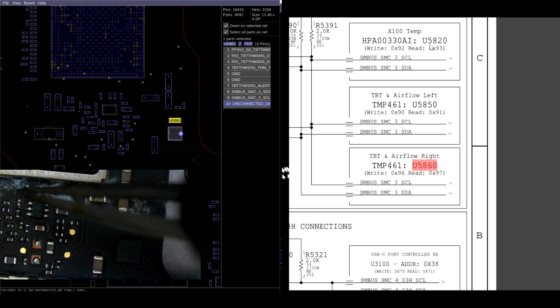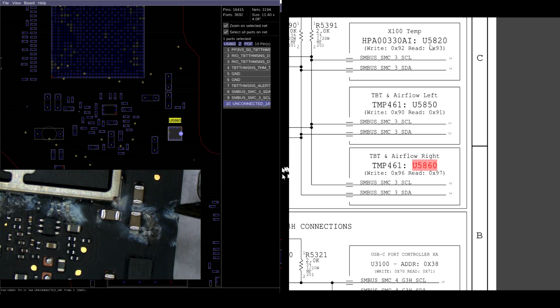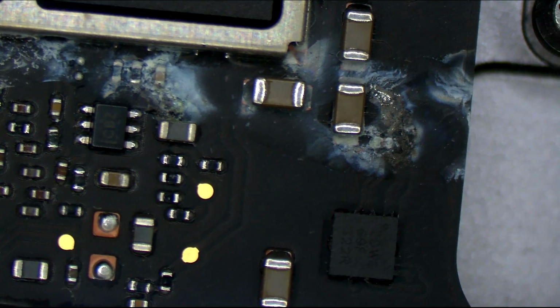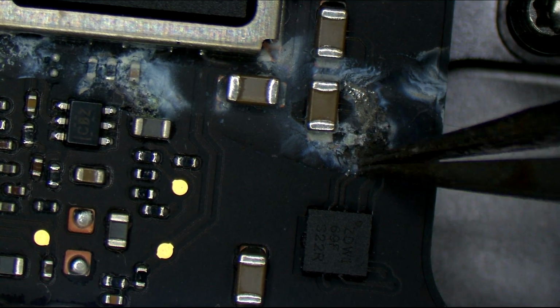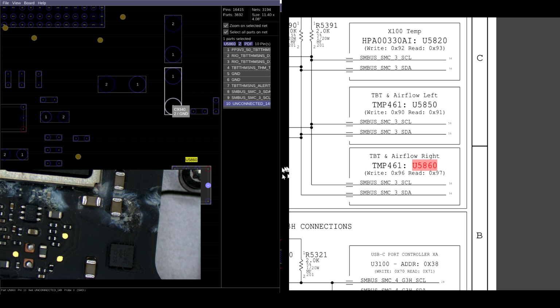Now, I'm going to guess that the stuff over here is not really that relevant, but that what's over here and closer to the chip that looks like it has lines going directly to the chip is relevant. So there's these capacitors, which I'm not really concerned about, but I am concerned about this resistor that's covered in soot, as well as that resistor that's also covered in soot. And they appear to be going to the chip. So let's see what those resistors are for.